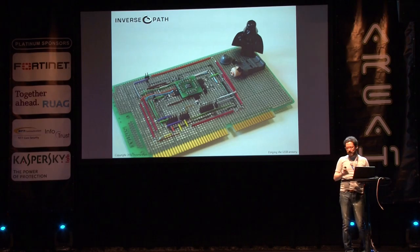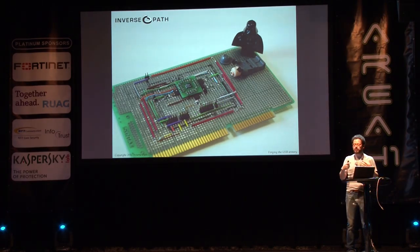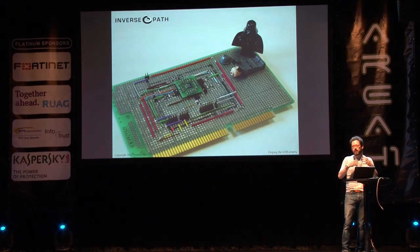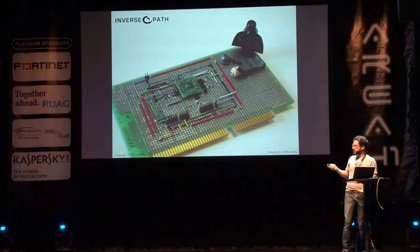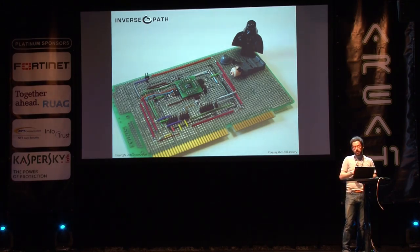But the problem was that the power regulator tolerance requirements are so tight that you really need to put all of the power components on a proper PCB with the proper distances. You cannot solder this on your own. And also the system on a chip needs to be on a PCB as well. So if you put the power on a PCB and the SoC on a PCB, you might as well put a USB plug and the microSD, and then you have the final board.